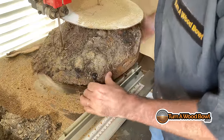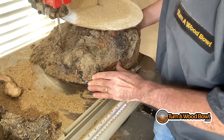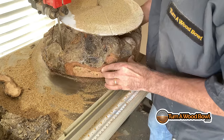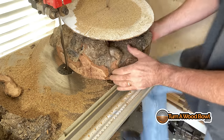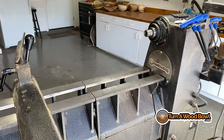This is a piece of live oak burl that I found after a hurricane a few years ago. Live oak wood is not the best wood to turn — there are a couple reasons for that. I found that it never seems to dry; it's basically always acting as if it's wet and it's always shifting and doing a variety of different things.